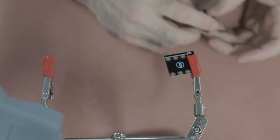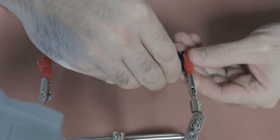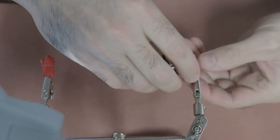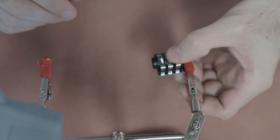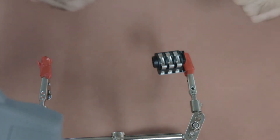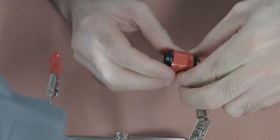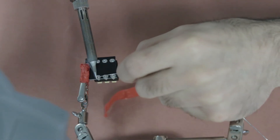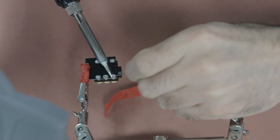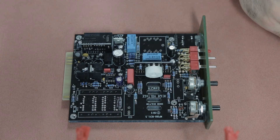The next part is to get the last little PCB and solder the jack socket for the DI input on the preamp. It's important to insert the component on the side of the PCB marked CN1, and you want the opening of the jack input facing out off the circuit board so it's orientated correctly later. Once you've confirmed the orientation by soldering one leg, solder the rest, and then cut these pins short on the board so they don't come into contact with the main PCB.